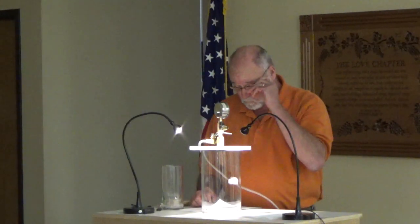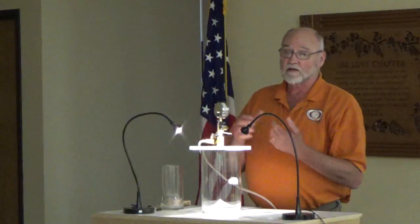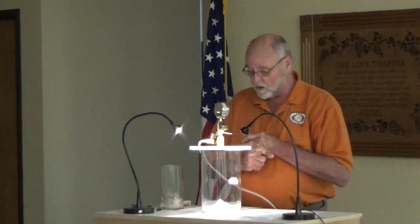Like I was saying, you lose about 1 inch of pressure for every 1,000 feet. So if you do the math, here in Jacksonville, Arkansas, the highest you're going to get is 29.48 inches of mercury. That's at perfect vacuum. If your pump and system can only draw 28 inches of mercury at best, you're only going to get about 85% penetration of resin. You've got to get as close to that number as you can. Less vacuum means even less resin gets in the wood. It doesn't matter how long you leave it under pressure, it's just not going to happen. You've got to get all that air out, or as much as possible.